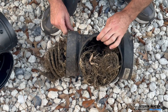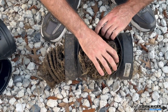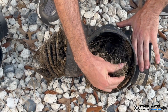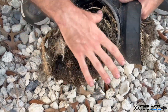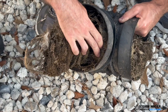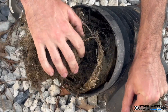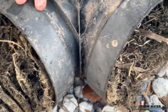This system was ripped out near a bunch of bamboo. Bamboo roots are notorious for taking out drainage pipes — they grow through everything and they grow all over. As you can see, this thing is just packed full of roots. This is the portion that was in the pipe before we pulled the pipe out of this blind inlet tee, and it is completely packed full of roots. That is why we would never use a blind inlet tee for a 90 degree turn.